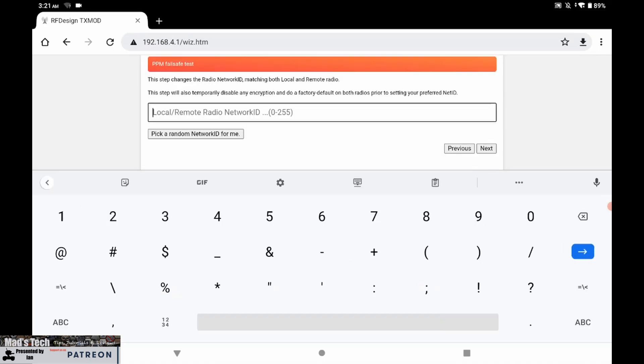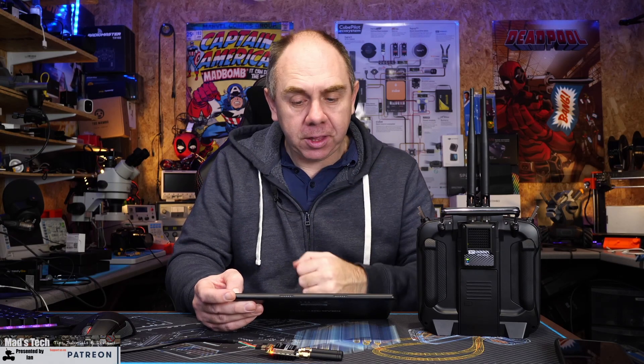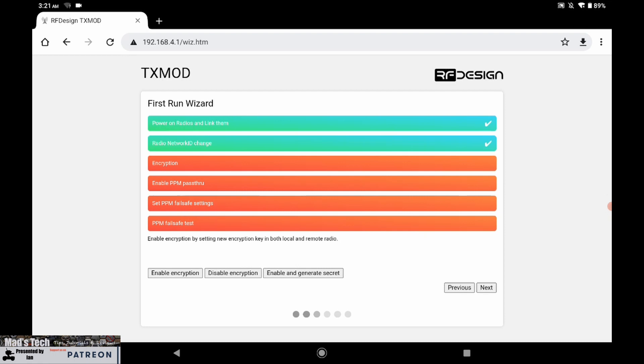You can see the LED changed and it's reconnected again, resetting the IDs automatically. It's important that your own radios have a different ID - especially don't leave them set as they come out of the factory. Think of it as a default access code and you should set it to your own individual one once you've set them up.